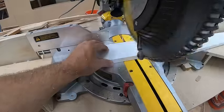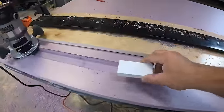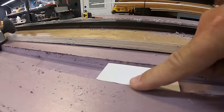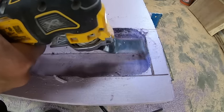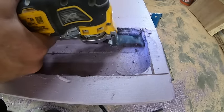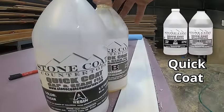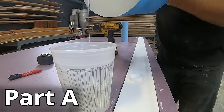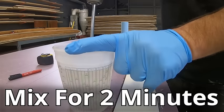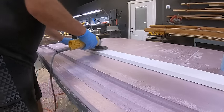I'll use a straight shank on my router, and then I'm going to apply some PVC board. I cut a little bit so I can test fit the height — it's perfectly flush. I'm going to square out those edges with my multi-tool, then I'm ready to embed the PVC strips for that backing. I'm going to use my quick coat to embed that so it stays permanent, and I can work on this project the same day. It'll dry in a couple of hours and be ready to sand.